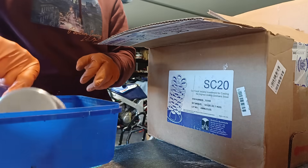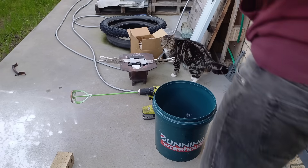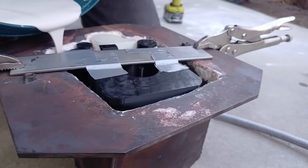Now we've got to turn that 3D print into a mould. So once again that means weighing out the investment and the water, hydrating the cap, mixing it all together and putting it in the flask, and then chucking it in the kiln to burn it out.